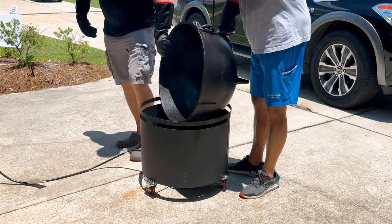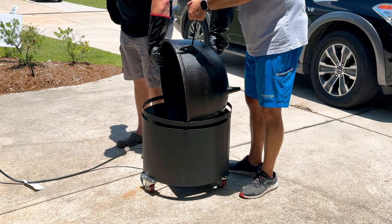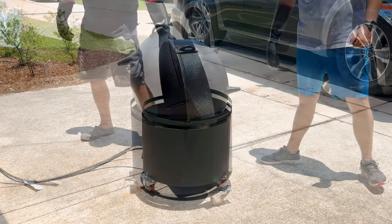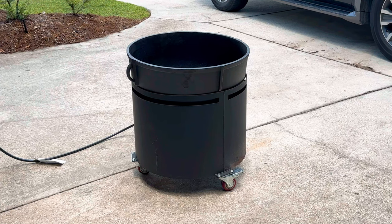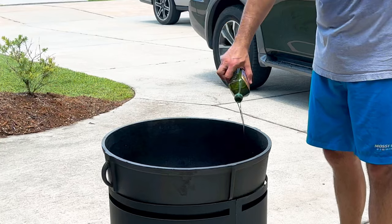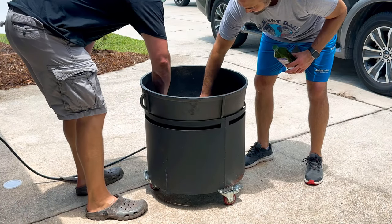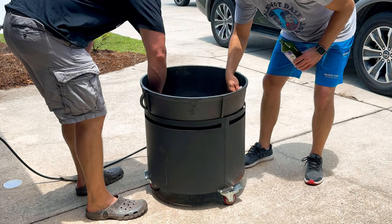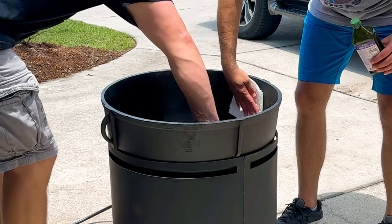We're just moving around from one side to the other side. We can't just leave it on the bottom, because the heat will not rise up the walls — you have to put it on its side in order to get those side walls polymerized. Make sure you have high heat-resistant gloves when moving this thing around.